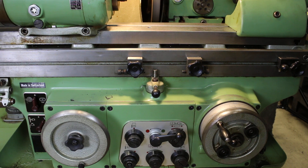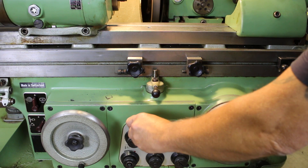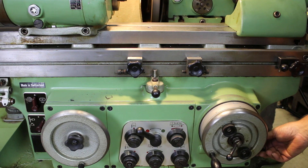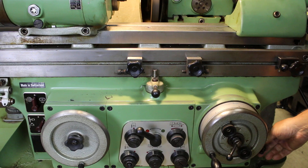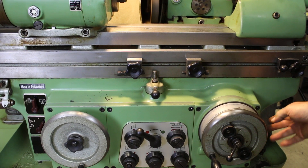You can't go into every little detail in a video. There is some way of adjusting the actual final size. You also have a fine adjustment on the side of the machine here that allows you to change this by millionths of an inch. There's a stop pin here.